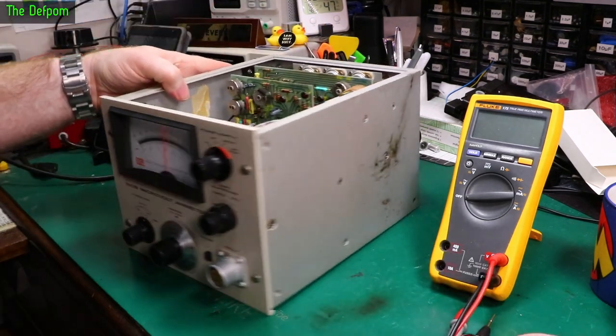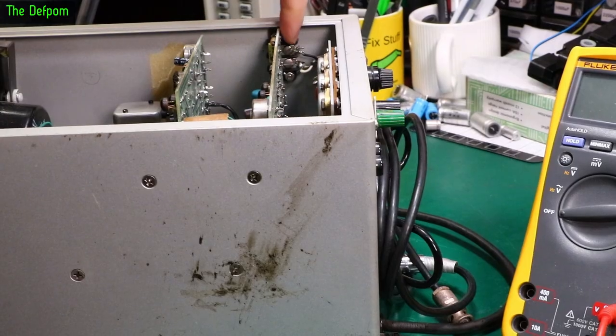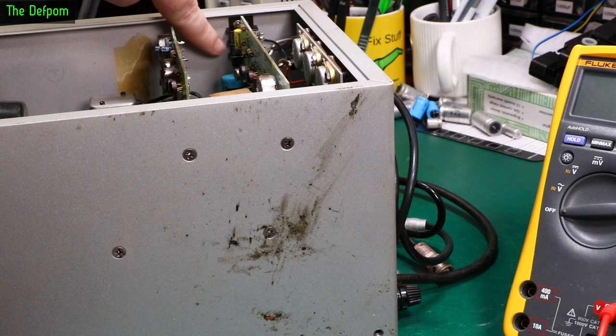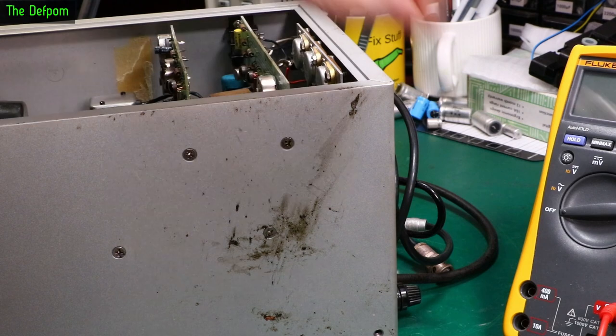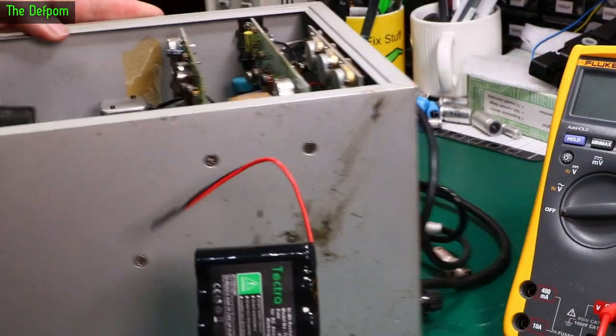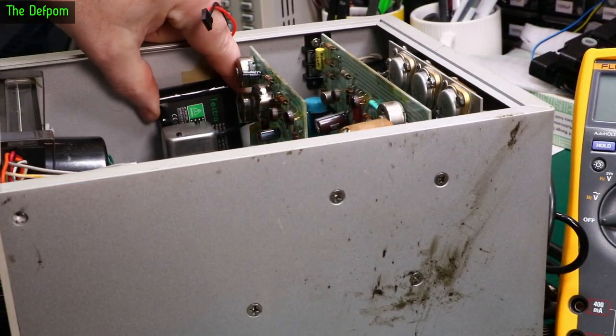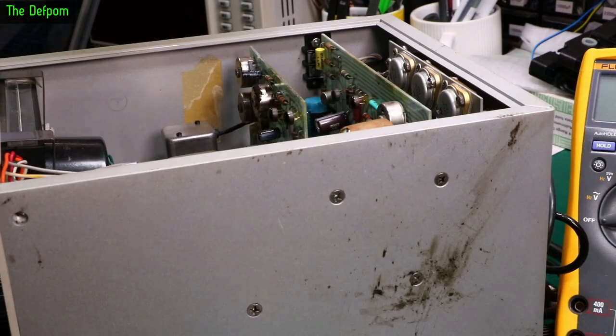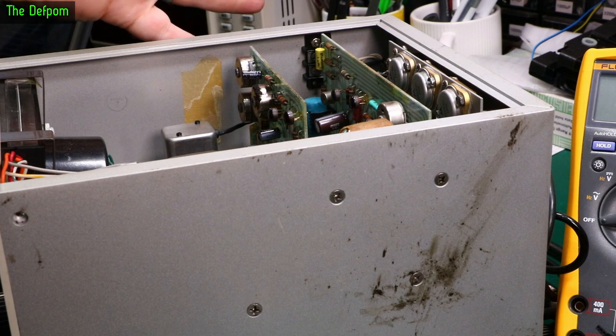But I want to measure on the side here, these terminals, that's where the connections go for the battery on this side. So there's actually a standoff mount here with terminals you screw the battery terminals onto. The battery's normally mounted down here. What I actually want to do is mount this down there. Double side tape this to the side. These wires can go straight to those terminals, all fairly compact, easy to access, that sort of stuff.